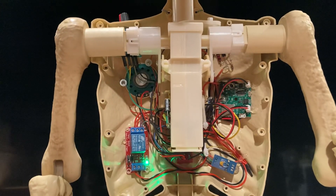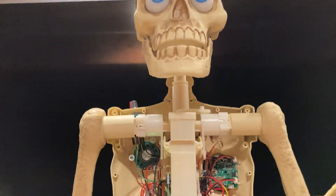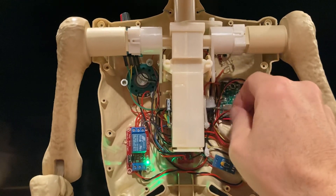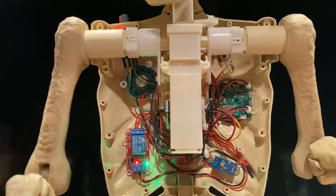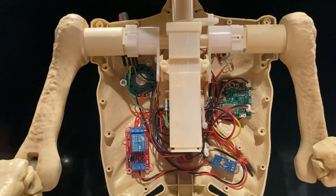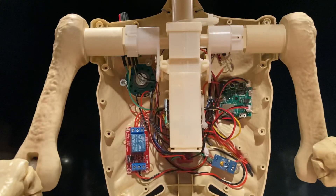Then I'm going to put the switch in the down position and now it'll run. If I kick him up, it will turn on the motor, and then the eyes will just come on steady. Then he'll have mouth movement with the audio. If I bring out the IR, he'll run through that routine normally. And then when the audio quits, this main relay shuts down, shuts off the motor, and shuts off the LEDs.